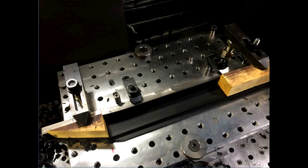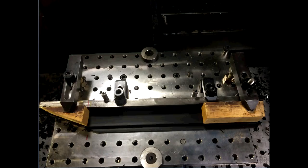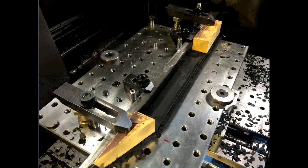Looking at the overview: I cut the right side, then I cut the angle. They're more difficult to deburr than to machine because they throw up fuzz everywhere. Two strap clamps hold the long bar in; the long bar is pushed up against two pins to keep it straight; and two more strap clamps hold the wood down, which presses it up against the bar. You can see how warped the vinyl part is — it's just a piece of vinyl — but this gives us some stability.